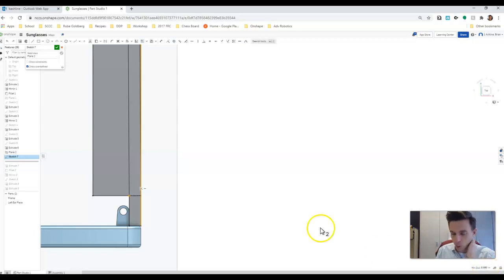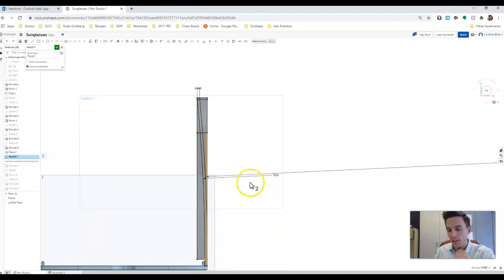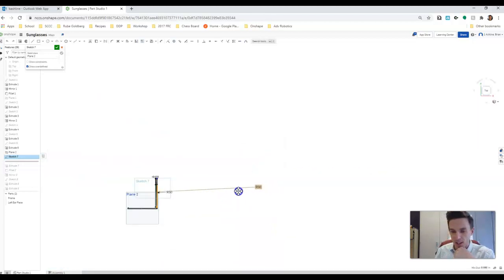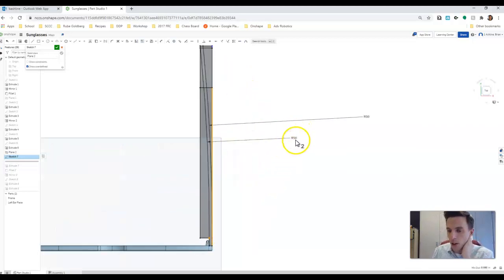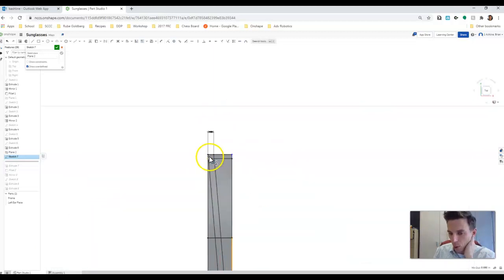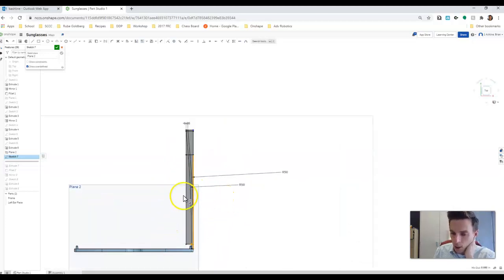That's 0.08 as well. So I brought back 2 arcs, and in my case I dimensioned both of those with a radius of 50 inches, right? So it's a diameter of 100 inches, which means that if I created a circle with a 100-inch diameter, it would follow the same arc. Because both of these radiuses are the same, and because they both start and end at the same point relative to one another, at 0.08 inches away from each other, they're parallel throughout the entire process.